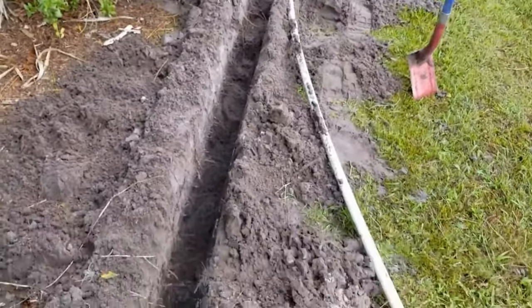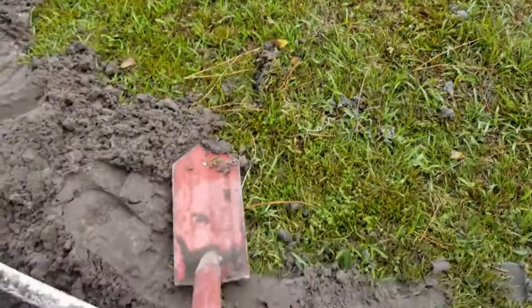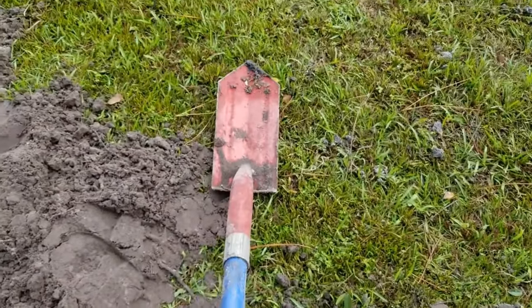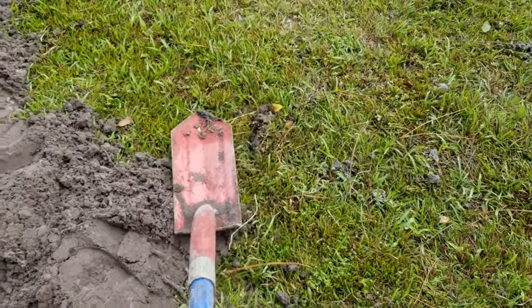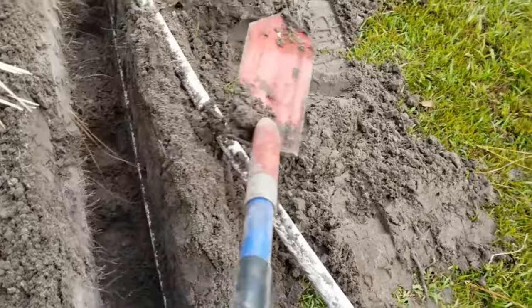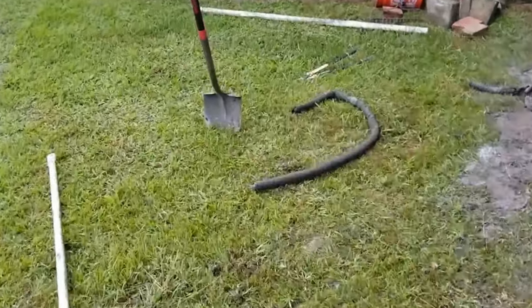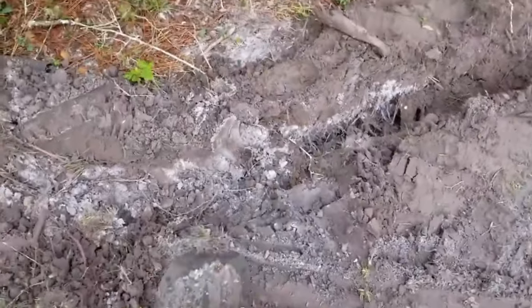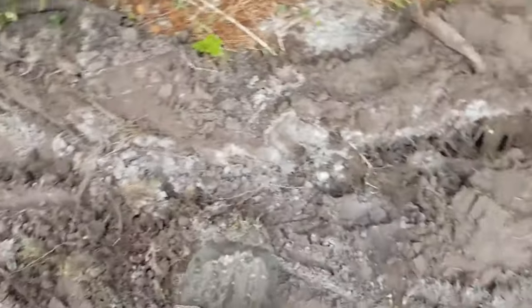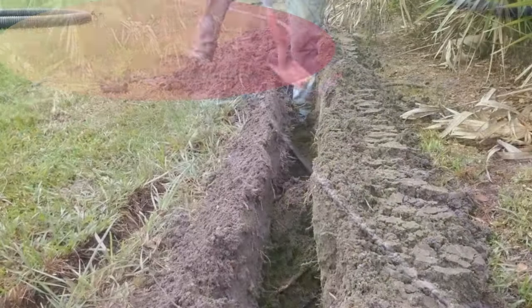You can see the depth we want to be at — I've already started with my trenching shovel. You can see my foot down there. This is a trenching shovel, and you need one of these if you're going to run a trencher because it's exactly the width of your trench — you can see it's six inches wide. The trencher cuts a six-inch trench. Your bigger shovel, which I've got over here, is eight inches wide, and I'll use that where we've got the excess soil from turning the trencher around. Then I'll still come back and use that little shovel to clean out the trench.